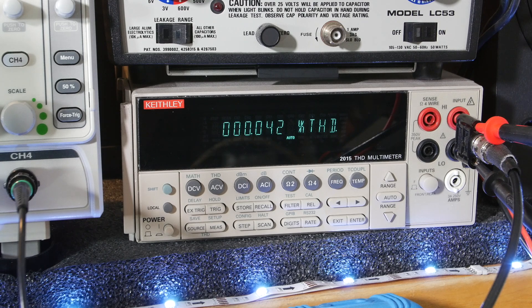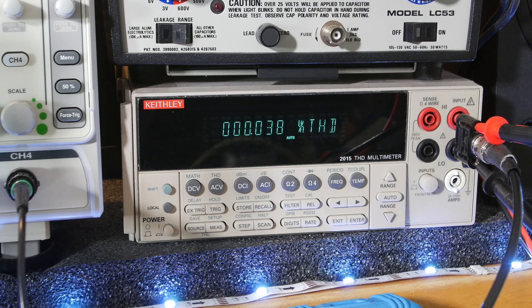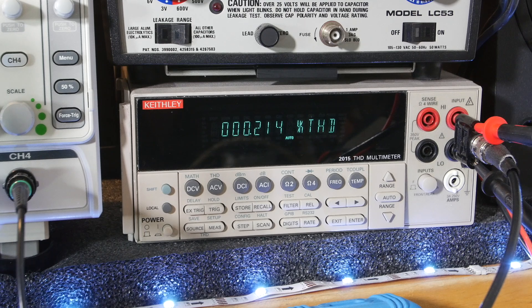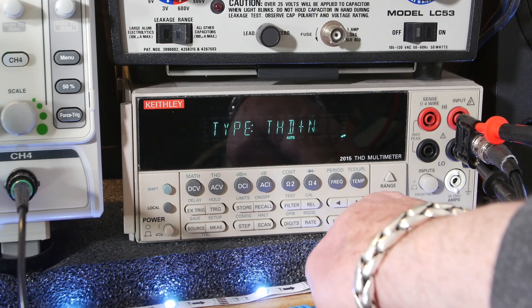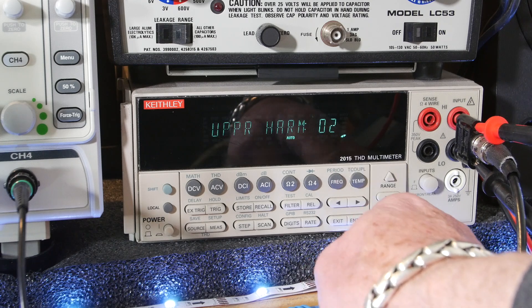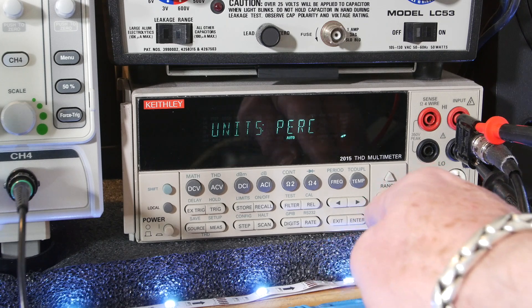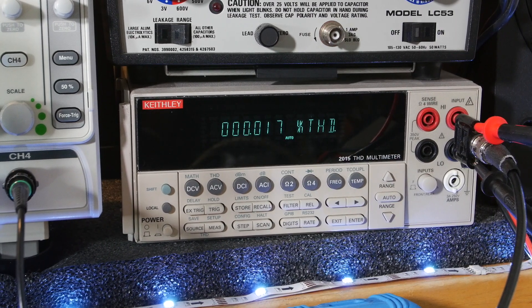Now let's go up to 7 volts. I'll go to 50 millivolts — these are all RMS values. I'm going to make a table with the THD. And with the THD I can just go to THD, enter that, and there are our harmonics. I'll go to 12 harmonics. I've experimented and I don't see any change between 2 harmonics and 12 harmonics, so this doesn't take into account the noise in between harmonics — it just reads the harmonics. You'd always think this would be a lower value than the THD plus noise.